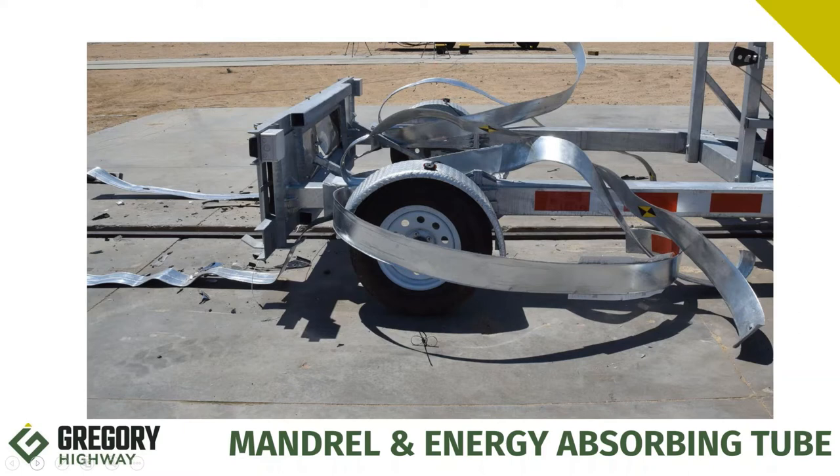Also, the straps of metal have no structural strength and curl up and away from the impacting vehicle, thus eliminating any hazard posed to the impacting vehicle. Furthermore, the straps of metal remain securely attached to the unbursted section of the tube. Thus, there are no detached elements that can be thrown forward and pose hazards to workers and adjacent traffic.